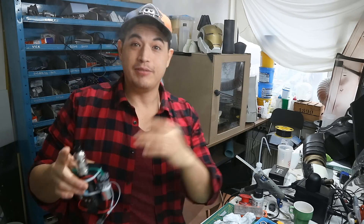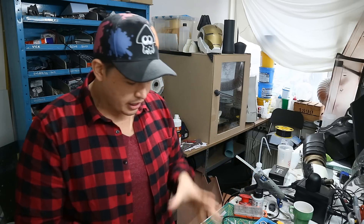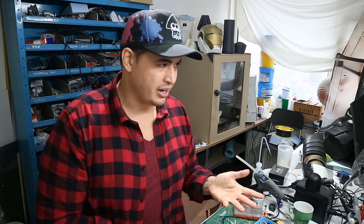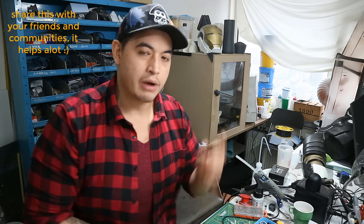That is how you build a big smoke machine while still being somewhat compact, if you want really big powerful plumes of smoke in your cosplay. All links to these products are in the description — most of it is bought on AliExpress. It costs a little bit more than the small vape pen because of the box, atomizer, and four high-capacity LiPo batteries. There are smaller versions that run with only two high-cap LiPos — you probably can't get them to 300 watts, maybe half, but they're cheaper. I saw a set for about 30 bucks. I'll find it and put it in the description. If you have any questions, drop them in the comments below, and I'll see you in the next video — don't forget to subscribe!